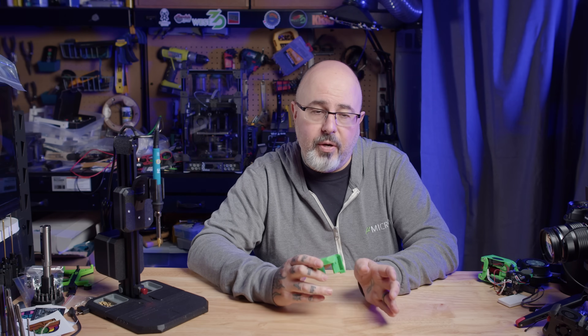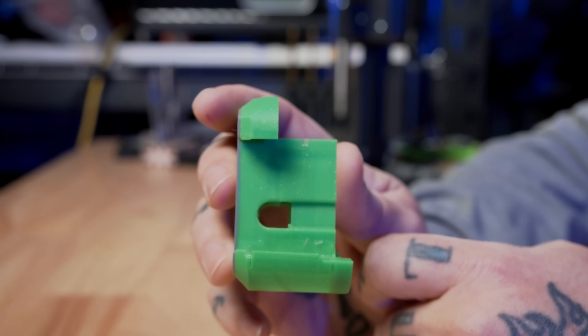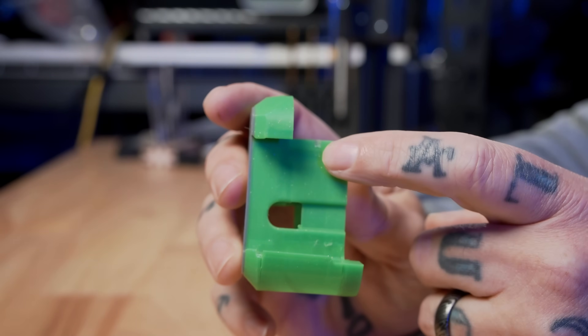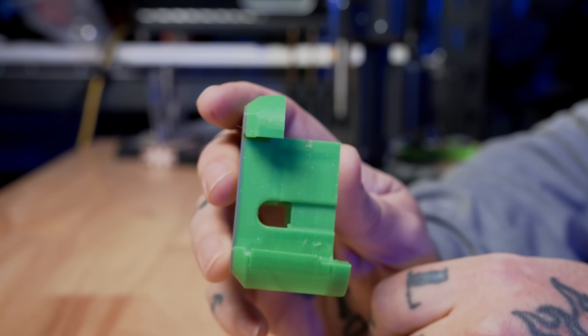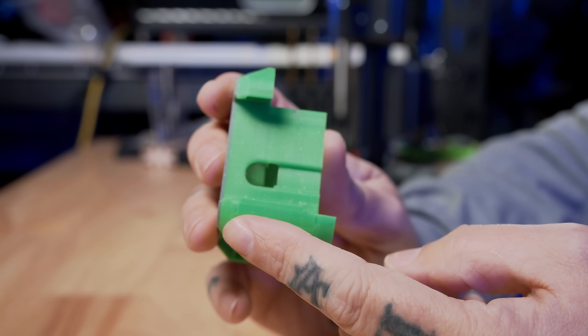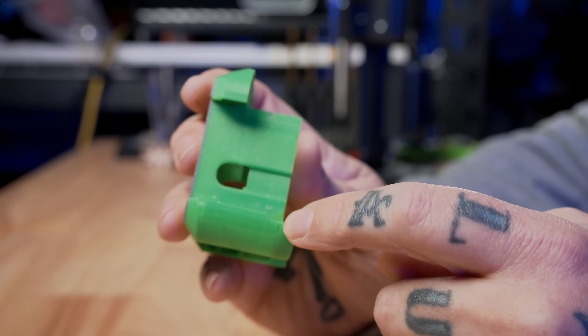While I was printing the parts for the Roto Vitamins conversion, I took a look at my Micron and realized that my toolhead was broken. At some point I used the wrong screw to attach the extruder, which came through the top of the mount, pressed into the 4010 fan and broke my ducts. You can see there's a chunk missing in the front and it's split in the back. I figured I could reprint another Dragon Burner, but I also saw that Hart K, who developed the Micron, has his own toolhead out now called the Ant Head, so I decided to upgrade to that.